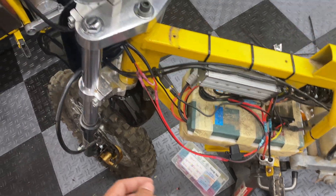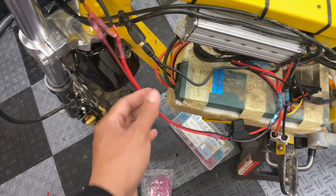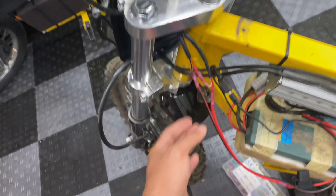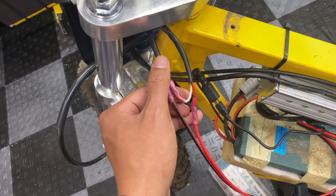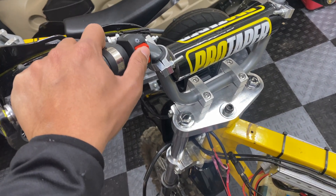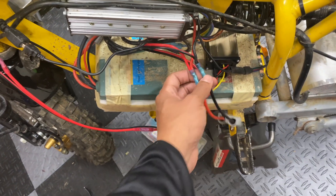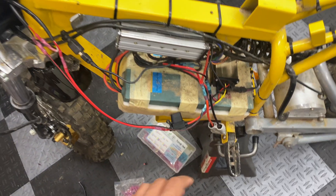Before I clean up all this wiring, I want to quickly go over how the switch is hooked up. So this is the power and ground wire coming from the voltage step-down converter. The ground wire just hooks up to the black wire on the headlight, and then the red wire goes to the switch. There are two wires coming out of the switch — one's an input and one's an output. The output just goes straight to the red wire, supplying power to the headlight. So all the switch does is either complete the circuit when you turn it on, or break the circuit when you turn it off. That's all it is. And here's how the controller looks all tied up — we just got to plug it in, test it out, and make sure everything works before we clean it up.